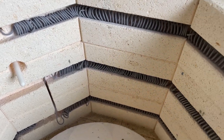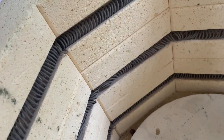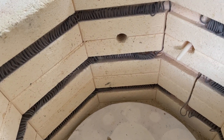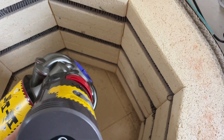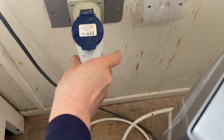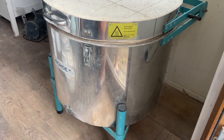Okay, so it's not perfect, but I don't have any elements sticking out anymore — not significantly anyway. And that means it's not going to get worse. I can hopefully get a few more firings out of this set of elements before changing them. Once I completed it, I gave my kiln a good hoovering out to get rid of any dust I had created. Then the time had come to test whether it had worked, and Little Derek was still firing happily — so I packed it full of bisque, switched it on, and hoped for the best.